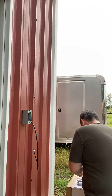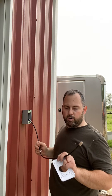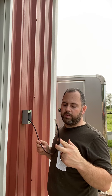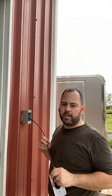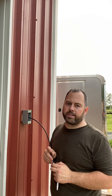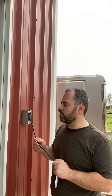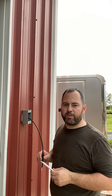So we're going to get started on that. Here we've got our electrical box all mounted up and ready to go, and our ethernet cable ready to go. This happens to be a Ubiquiti tough cable, which is actually pretty nice for outdoor use — it's got a really heavy shield on it. It's a little harder to work with than your typical Cat 5 or Cat 6, but it's pretty nice cable and the shielding really helps this stuff last if you've got thunderstorms, static electricity, and things like that. It's not particularly expensive — I like to use it for camera installs and also UniFi Access.